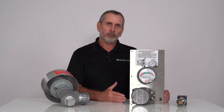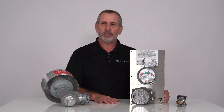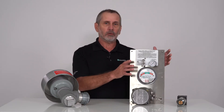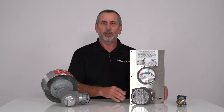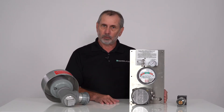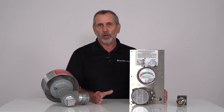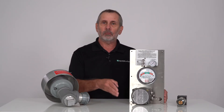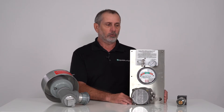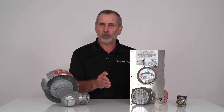The reason why there's a WPS and a WPSA is the WPS is a Group C and D rated pressure switch, so it can only be used in a Group C and D area. If you have a Group A and B hazardous area, then you have to go with a WPSA. So from a certification standpoint, it actually covers more of the groups, and there should be no real issues with going from a WPS to a WPSA.